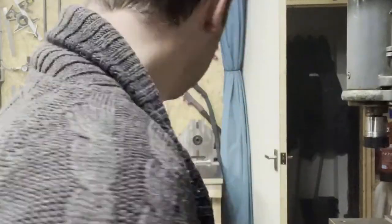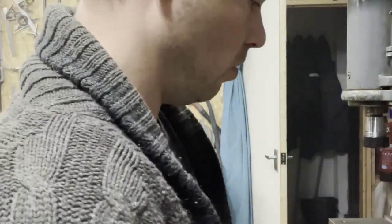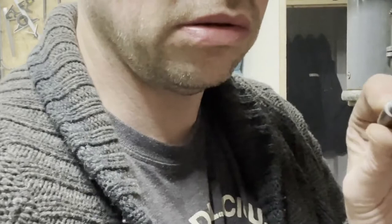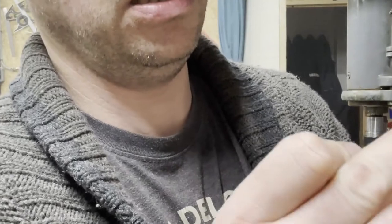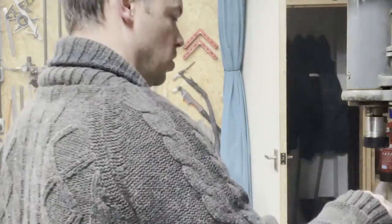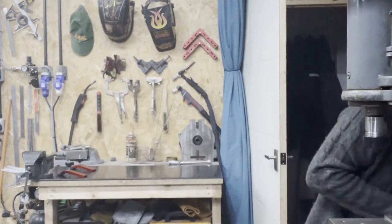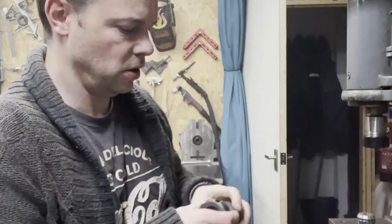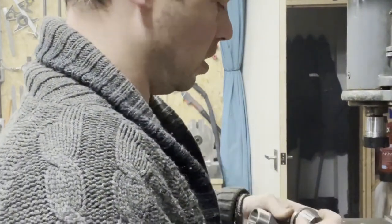So, at some point when I was talking to you before, the battery died. Nothing exciting has happened. I think what I was doing was showing you a little doodad. So now we're going to machine the little hex top onto this. To do that, we're going to use a 10mm, which should be the right one. Chuck this into a hex collet block.